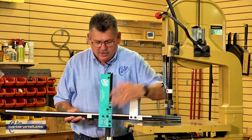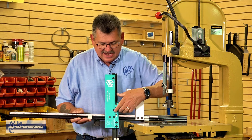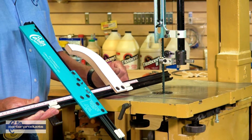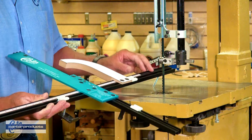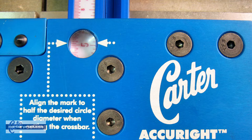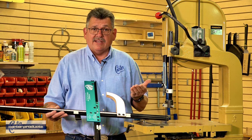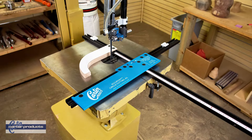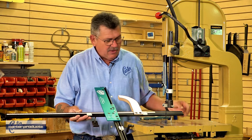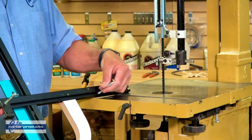It has resting points that are movable so that you can hold your work level. It has a sliding magnetic pivot point so you can bring it back to drop your piece onto the circle cutter, and of course it also has a tape measure — whatever it reads in the hourglass, double it and that will tell you what size circle you're going to cut. It will cut anything from 1 to 48 inches. The way it's adjusted, loosen these two screws and slide it out — it adapts to your saw with pieces that slide in and out.